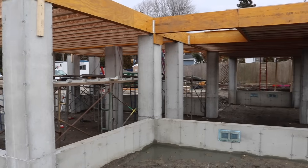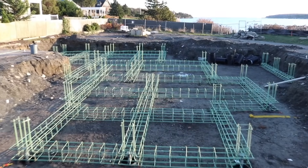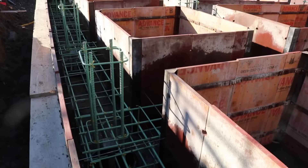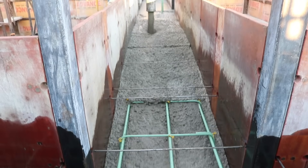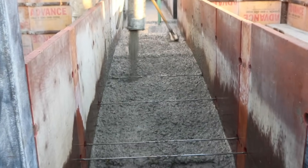If you have not seen episode two of this build, go check that out. I talk about the grade beam construction — essentially the footings here on the project — how that was constructed, and the provisions that we put in place in the grade beams to make way for these concrete piers. Essentially, we left some one-inch epoxy-coated rebar dowels stubbed up vertically in the locations of all these concrete piers.